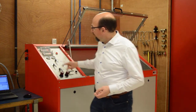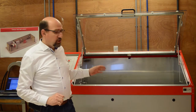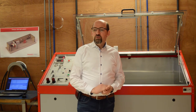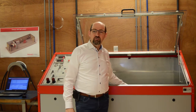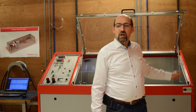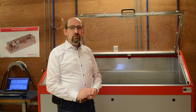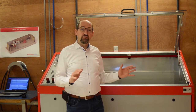Also on the left side you find the main switch to activate the complete system. On this specific unit you will find on the right side of the cabinet extra connections. Those connections are used if you want to use a bigger test area for hoses that cannot fit into the test chamber. Those connections are an extra door switch and the inlet and outlet pressure connections. Please be aware that when you want to use this feature you have to do your own risk analysis on the complete specific combination.